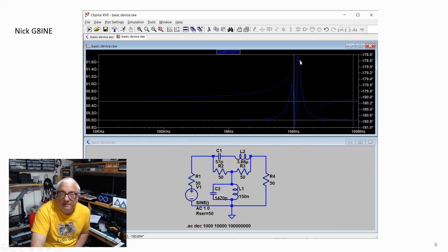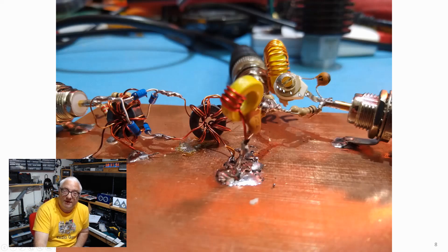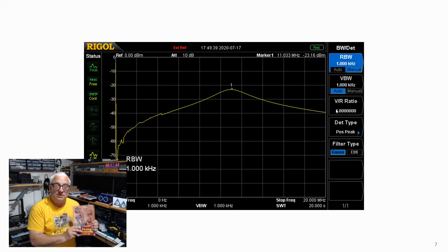There are two peaks in the simulation because both tuned circuits should have a resonant frequency of about 10.7 MHz, and when you physically make this thing you need to line them up one on top of the other ideally. My physical build swept from 0 to 20 MHz looks a lot wider than expected, but I've managed — by building it with a variable capacitor on one of the LC circuits and squishing and pulling apart the windings of the inductor — to get them to match quite nicely. So I'm going to stick it on the bench, replicate the test circumstances described in the book on page 57, and see how close we get to the IMD figures that Eamon claims he saw when he built it.